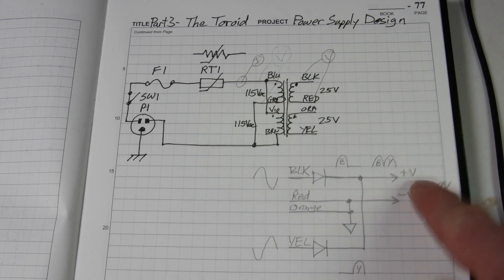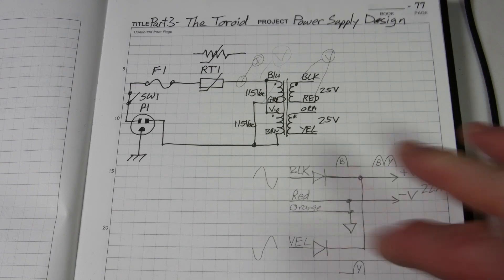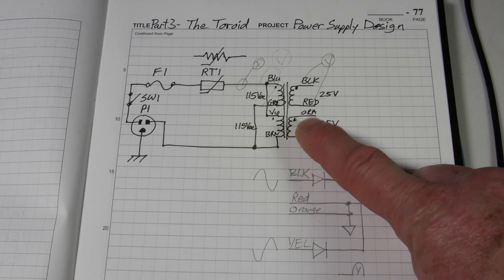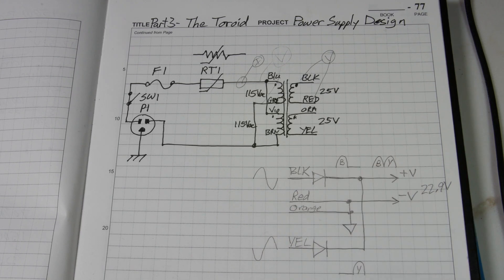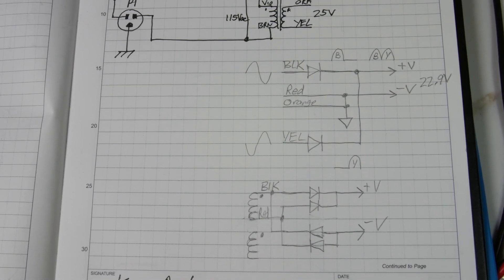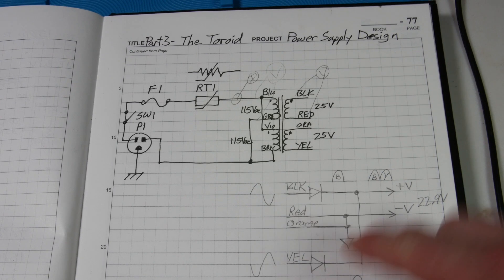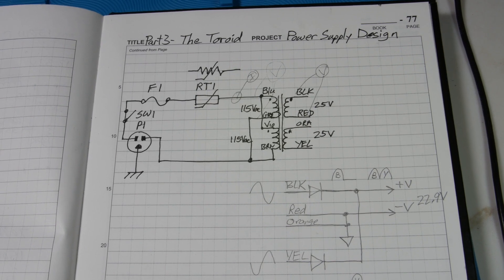What we did was show how we could get an output voltage that's fully rectified — pulsing DC — with two diodes using the center tap. We just center tap these and get one pulse when the waveform is positive, and when it goes negative this becomes positive and we get a positive pulse, giving us two pulses. Now what we're going to do is use an isolated winding. When hooked up this way it looks like one big winding with the center tap.